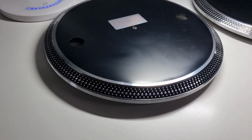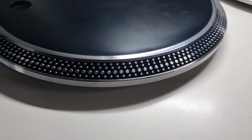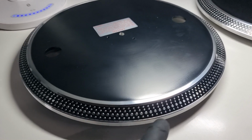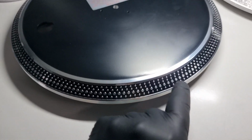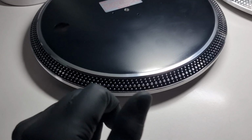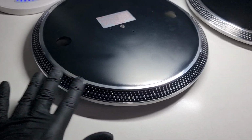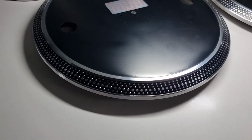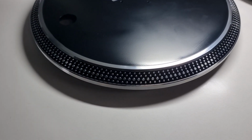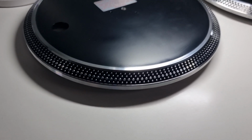So it goes through the machine on a very light mop, nothing abrasive whatsoever, very, very light abrasive. The last thing you want to do is hit anything with Scotch-Brite or any sort of really high abrasive pad. That is where you start to run into issues. I'm not going to tell you how to do this, but the trick with these platters is time and persistence. Do not go straight in full board with the heaviest, hardest compound on cloth, sand and block or whatever, because all you're going to end up doing is scratching and removing that nice sharp finish that you have on the platters. It's going to make them round and smooth like everything else that you've seen dotted around the net where people refurbish these platters and turntables in general.